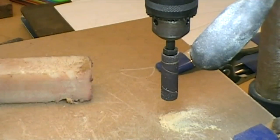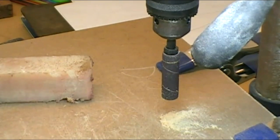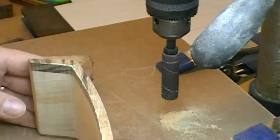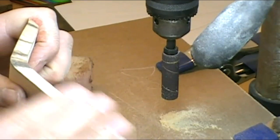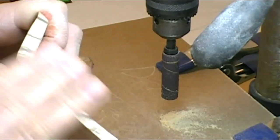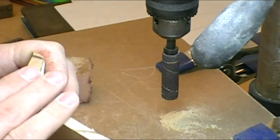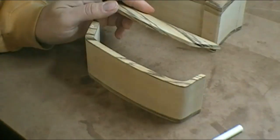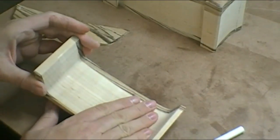All right. So I'm going to get this hand sanded, then we're going to get it back over to the glue up table over there, and we're going to glue on the front and the back sides. I'm going to clean this up just a little bit, a little scuff sanding with maybe a 400 grit sandpaper or whatever, just so we can have a nice flush mating surface on both sides. Right, so we've got our interior drawer that's been sanded.